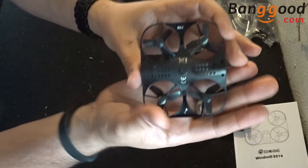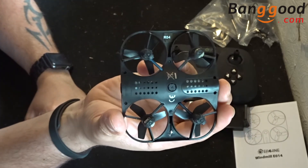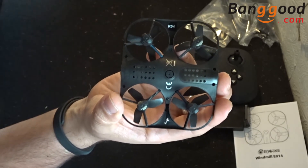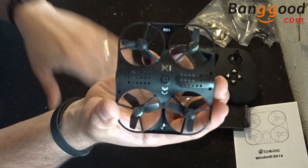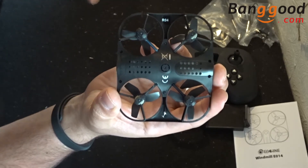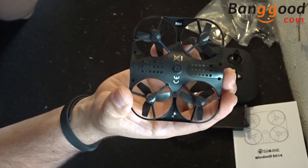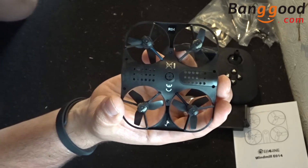If you flip this over, you'll see a little camera on the underside. This is a vision system — an optical flow system. What this does is take a photo every few seconds, analyse it, and check how accurately the quadcopter is being held versus that photo. If the current view looks different, the quadcopter will adjust itself until it matches the stored photo. I like optical flow systems — the majority of them work and work well, and I think this one is going to work very well also.